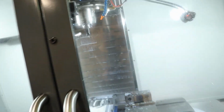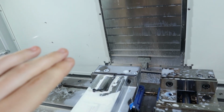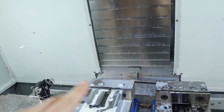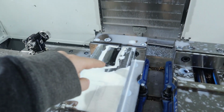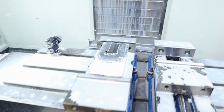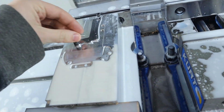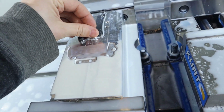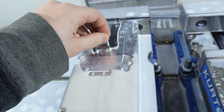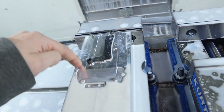All right. We chamfered that thing, just got the burr off of it, that's cool. Now what we're going to do is take tool 2, which is a 3 flute 1/8, and like I said, go down in this hole and bore pretty far down so our dowel pin fits. The boring went good, so I didn't hit the tool on the thing. I thought I was going to. It was really close.